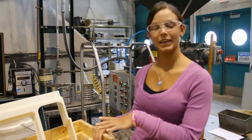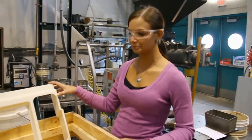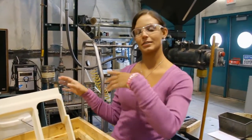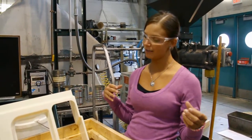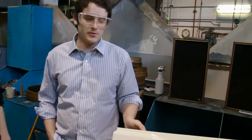I'm Katie. I'm working with Michigan Tech Senior Design Program. We're working with a company in industry — this is actually for the Jeep Wrangler. I'm going to be casting an aluminum structure to change the back swing gate of the Jeep Wrangler. Currently the gate weighs about 40 pounds and our goal is to reduce it by 10 pounds. We were commissioned by Chrysler to reduce the weight of the swing gate.